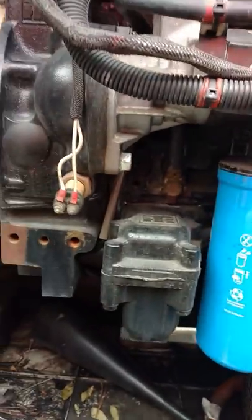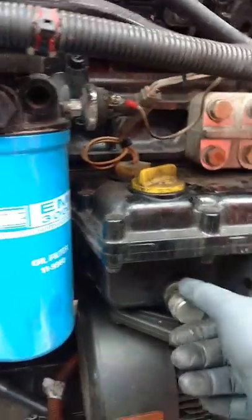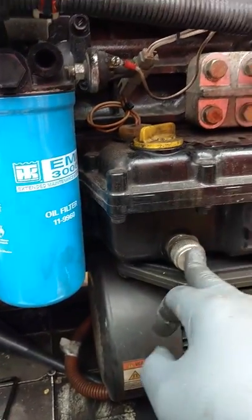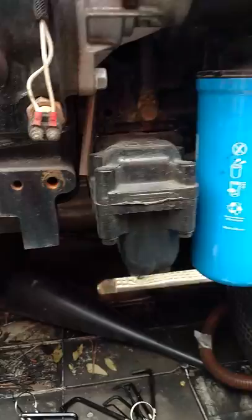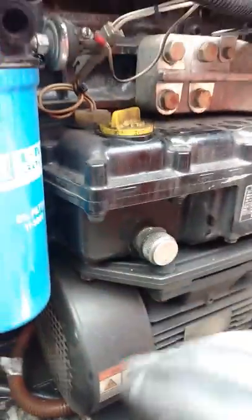I think I gave you a pretty good idea of just what stuff is. Here's where I fill up my oil — this is the plug right here. When I do an oil change, I take that cap off and there's a quick-connect fitting in there. I had to buy a specific hose from Thermo King that fits that quick-connect fitting, so when you change the oil you just click it on and the hose goes straight into your container. Very simple.